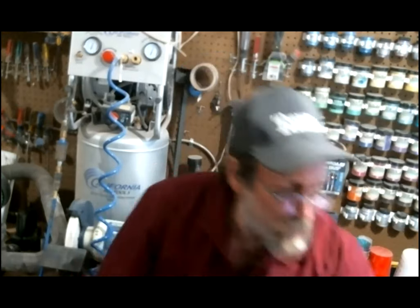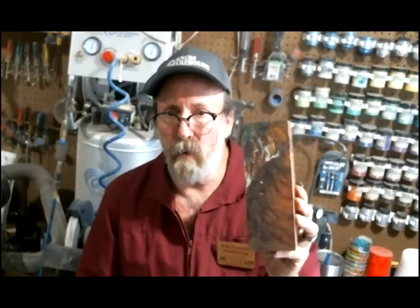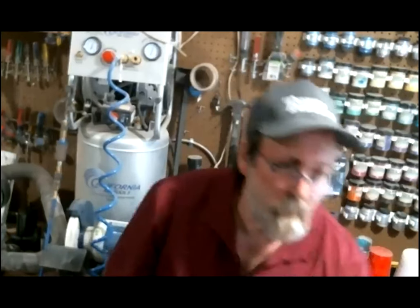When I say larger, this pepper mill was made with Alumilite Clear. So this is the resin that's made for pen blanks and smaller stuff, and we use it for everything up to about this size. If you're going to do a bowl blank or something bigger, then I would suggest you go to Alumilite Clear Slow. The reason is that you have a longer work time, and it doesn't set as fast. It takes longer to set, so you don't have as many problems with heat cracks and stress cracks and things like that.